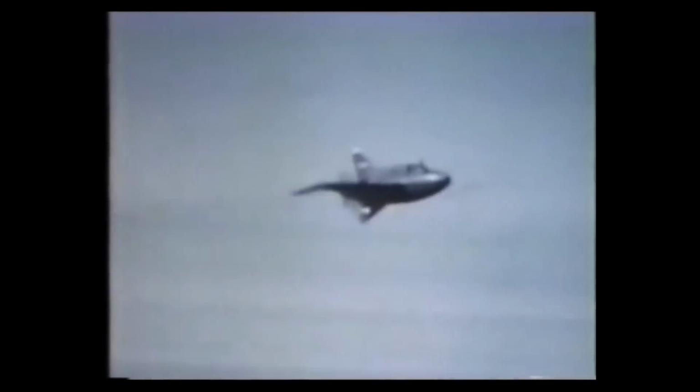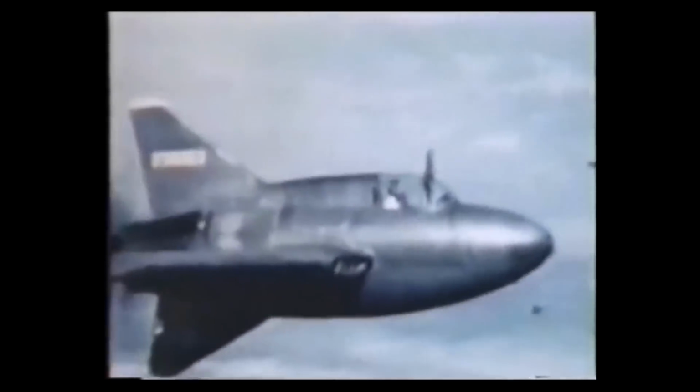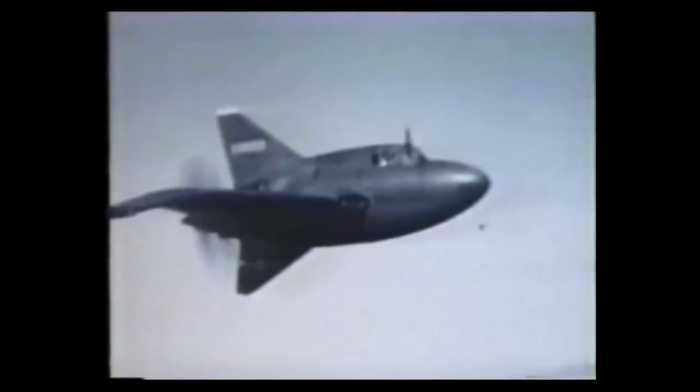Contra-rotating propellers have been around and tested for a long time, mostly in the aviation world, and it works something like this. Air flowing through a propeller disc creates a significant amount of rotational airflow. This rotating air is essentially wasted energy. However, what engineers discovered is that if you place another propeller right behind that propeller, but spin it in the other direction, it can take advantage of all this disturbed airflow.